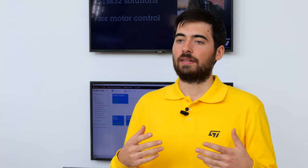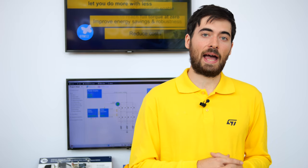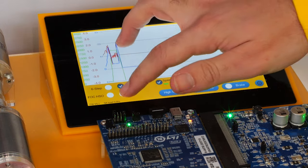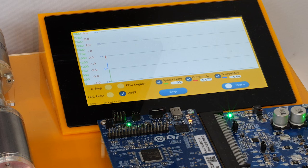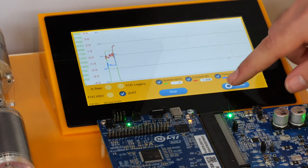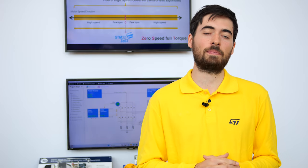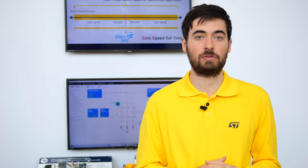Perfect for a flying start. The High Sensitivity Observer improves sensorless control by reaching ever lower speeds and even switching direction. You can also add the STM32Zest on top of the HSO, which is the first solution capable of providing full torque at zero speed, for any kind of synchronous motor. Both the STM32Zest and HSO are pure software algorithms, which means no additional active components are required, and they run on a simple MCU, such as the STM32G4.